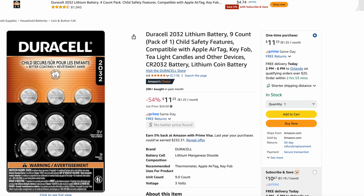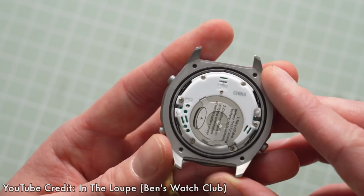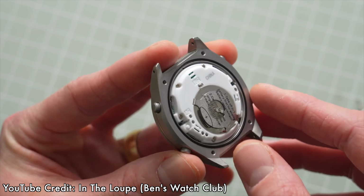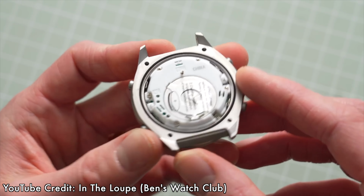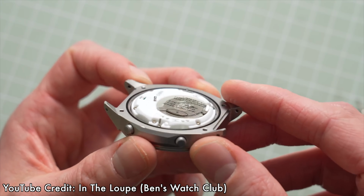No, so this is two things that were a bit complicated. The 2032 battery should hypothetically give it extended life, and it should be a longer battery than 3 years. We say it's a minimum of 3 years because the factory can't account for all the ridiculous things that we want this to do. There's obviously temperature, and we can go into the high accuracy quartz conversation, but we don't need to go that far down the road to realize electronics are going to be sensitive to all sorts of things, and battery life will depend on that. It's like when you look at the instructions on anything that comes with batteries, it says this is the operating temperature and stuff. So the 2032 with that battery capacity is huge, but it also means that we're able to keep that module pretty much for sure running, to ensure that there's sufficient and regular power, and that it's user replaceable.